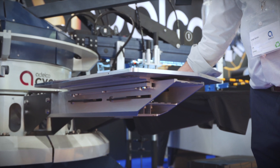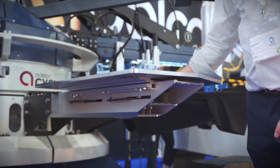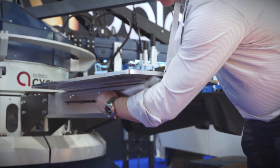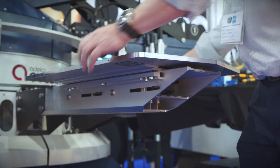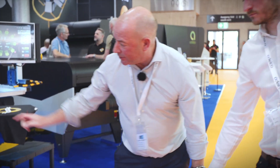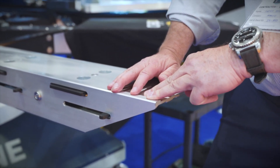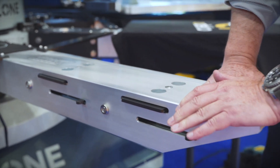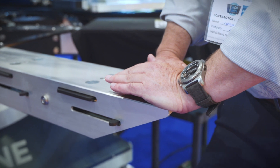The clamping device is tool-free — very quick and simple to adjust the pallets front to back, or remove and change them completely. Two levers on the side of the extrusion tuck away out of the way of loading shirts. Pulling them forward releases the clamping mechanism, enabling you to slide the whole pallet off very simply. This honeycomb lightweight pallet works very well on big machines for much faster indexing. The pallet arm itself is a bespoke extruded aluminium section with all the clamping mechanism built in — very rigid and strong, with no pallet deflection whatsoever.